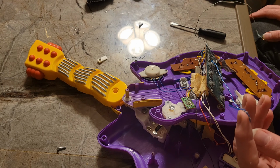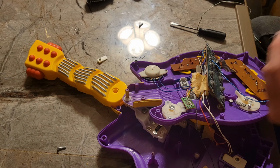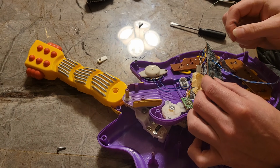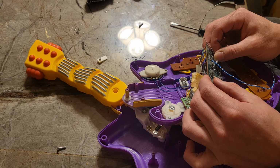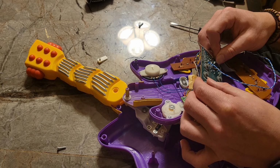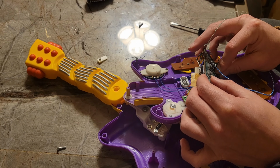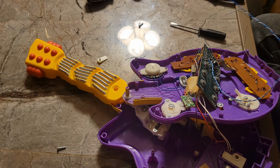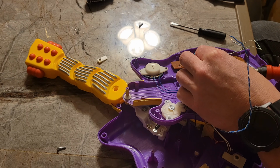As you can see, this one is actually making it go up too. So that's not what I remember happening, but playing around with the board, let's go ahead and find something that makes it go lower pitch and we will reroute our ground to that. Pretty good right there. So this is some other point coming out of the integrated circuit on the side here. So let's go ahead and tag into that with our ground wire. It is just right outside the integrated circuit.